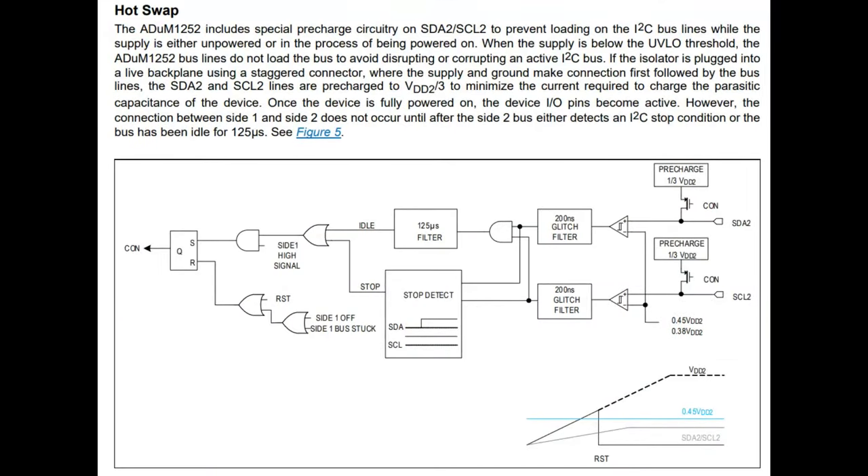There's also some extra circuitry that's nicely added in. They added a hot swap controller. If you're doing safety isolation, you probably also want to make sure you don't end up with a stuck I2C bus, which can absolutely happen if you hot-plug a device or if a wire gets jiggled. Something can come in at the middle of an SCL pulse and get very confused — it wants to see eight SCL pulses before it knows what to do next. So on one side, there is a pre-charge and a glitch filter. It determines when you're actually at a stop condition on the I2C bus, then connects the two sides together. You can also use it as a hot swap controller — it's a two-for-one, you don't need a separate hot swap controller.